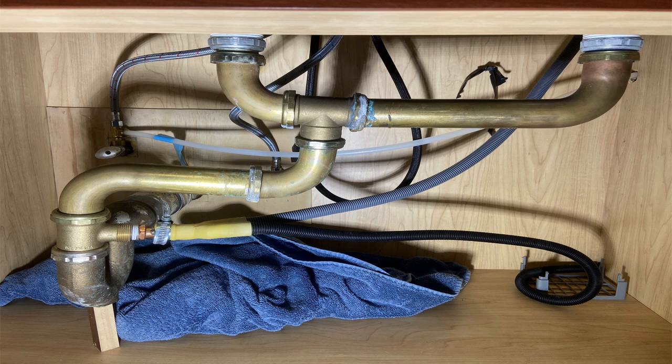Well, as you can see, everything's back pitched. The water's laying in those pipes. And you could see that nut on that T on the right side. It was leaking. There was a drip in it. And this was like Friday, and I wanted to leave him a way that he could use the sink. And I knew that if I tried to put the wrenches on here or pliers, these nuts weren't going to come off, and they didn't. I ultimately ended up having to cut them off.